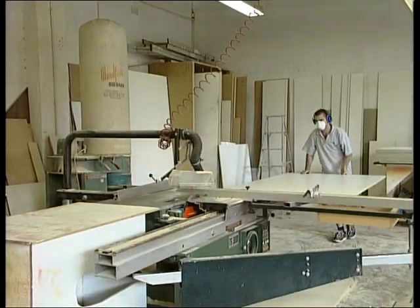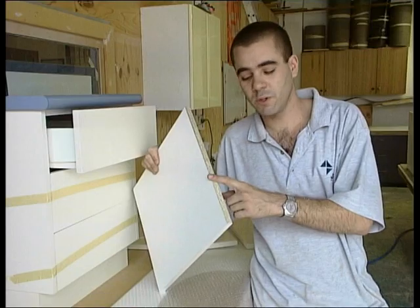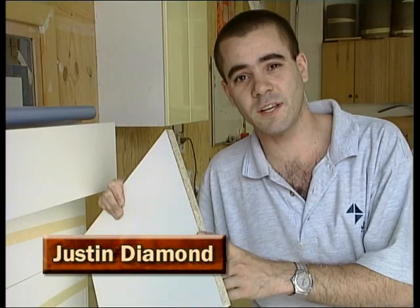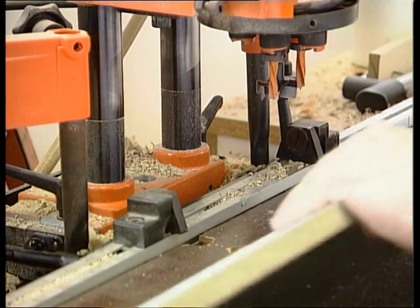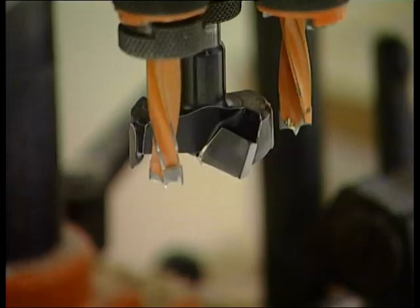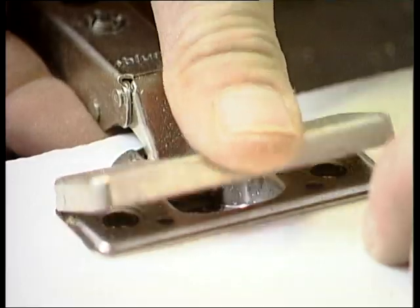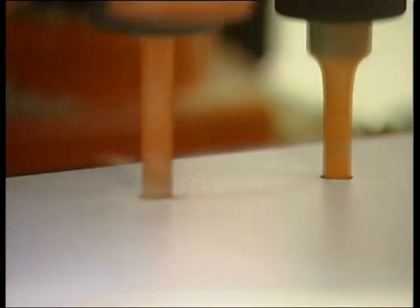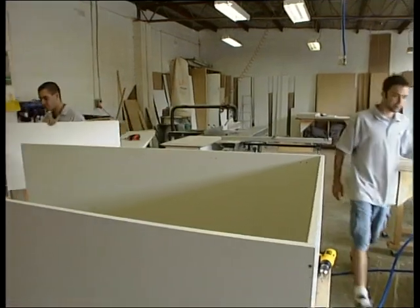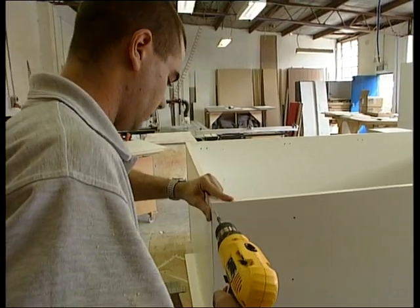This particle board is used to make bench tops and kitchen cabinets. The main product we use is this chipboard, and we use it for several reasons. The first reason is that it's moisture resistant, which means it can be given a ten-year warranty against any dampness or moisture damage. This material only comes in white colour, and we use it for the carcasses inside the kitchen or wardrobe, and for kickboards and other unseen parts of the kitchen. We put edge tape on the chipboard to match the edge to the panel colour to get a complete finish.